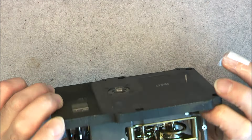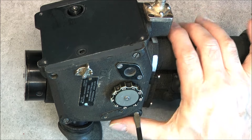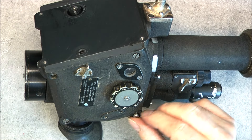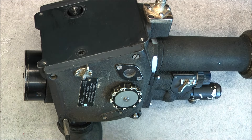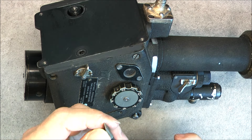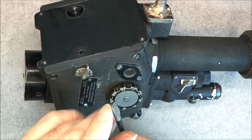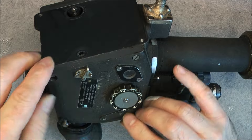I will undo this cover — the second module will come with the cover so it should be pretty straightforward. Is the screwdriver even fitting? This is always a problem with slotted screws from back in the day — the slotted screws had sometimes thinner slots than now, and the screws you find in hardware stores come with screwdrivers fitting their own screws. It is very hard to find larger screwdrivers with a very thin tip — you need to modify them yourself most of the time.